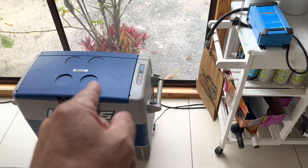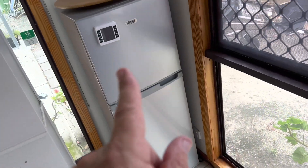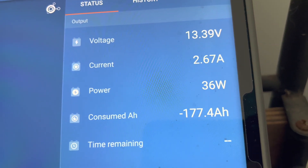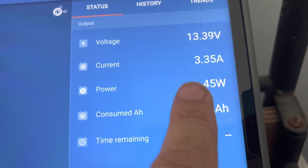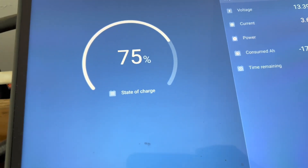The system runs our household fridge, the Kings 60-litre chest fridge-freezer (that's just on fridge with the beer in it), and the Brass Monkey upright fridge-freezer — so all fridges are cycling. We're gaining 2.7 amps, so we're still charging. All three fridges are cycling and we're overcast, and the batteries are still charging. Some days my batteries are charged by 10:30 in the morning.